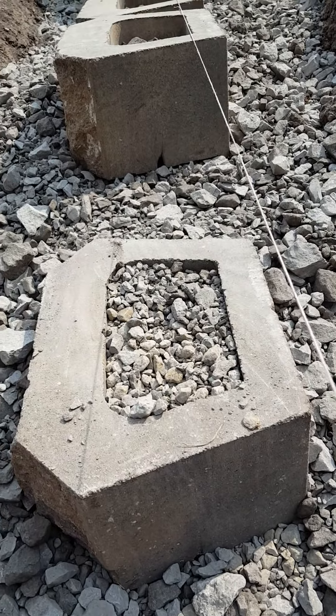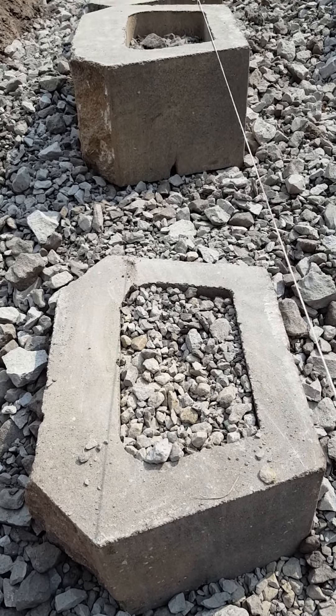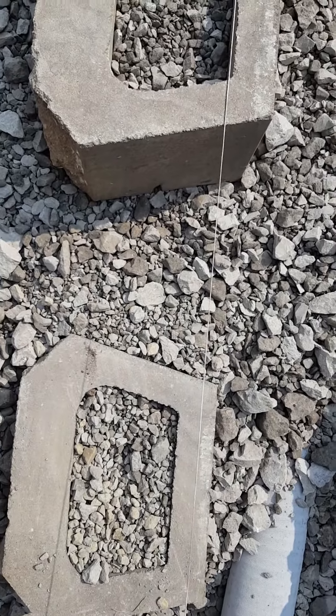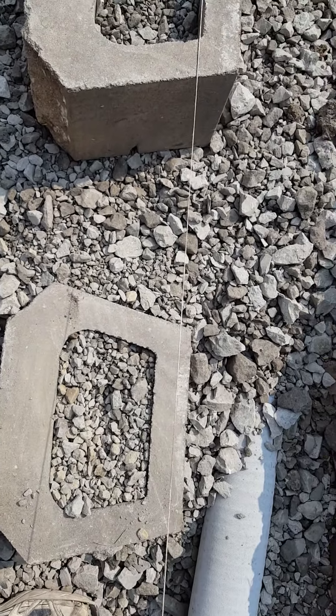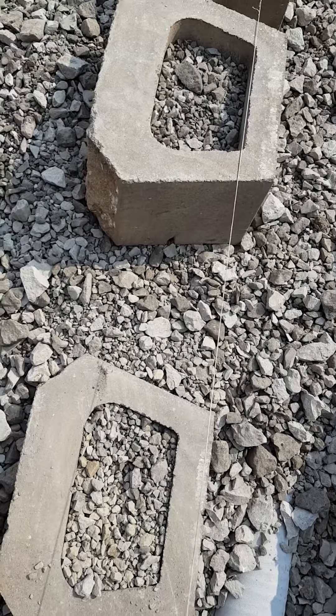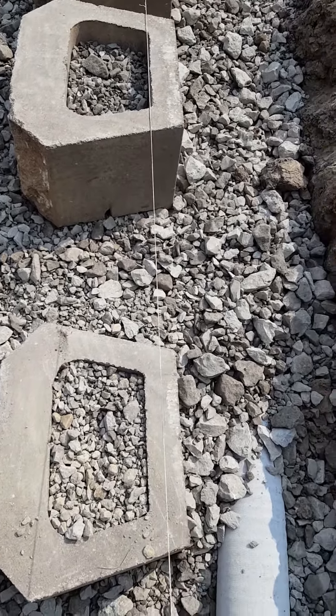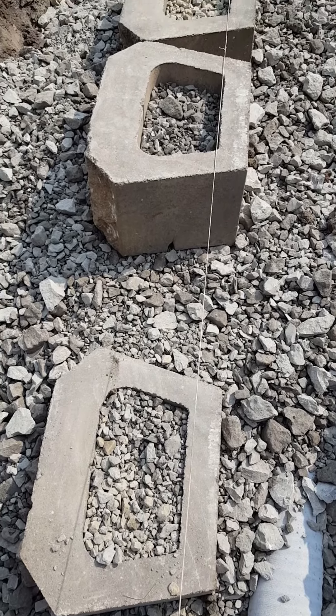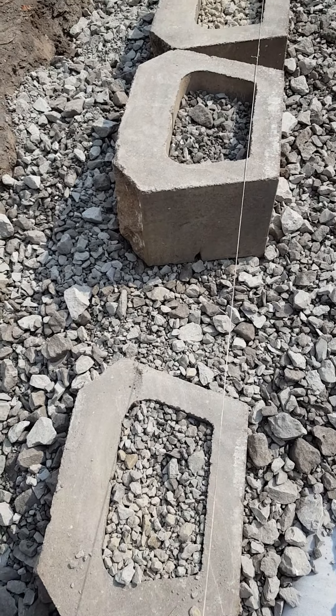This thing's a little out of level, but I got it filled with rock, and I'll kind of level it out. But this next block — if you look here — that bottom row will be right in the middle of it, which it's supposed to be, so you have proper overlap. And it's lower, one course lower, so it'll be one inch further away from the hill.